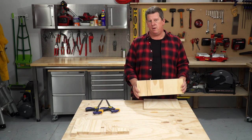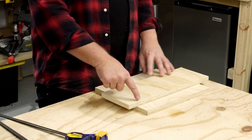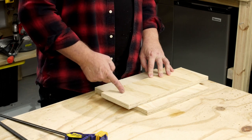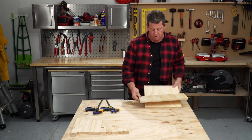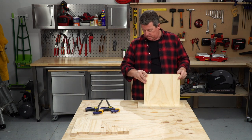The smaller piece of your plywood is going to be the foot. You want to find the centre here. This is 150mm so that'll be 75mm in, and then you want to put a little mark at 50mm in at both ends, because that will tell you where to position your upright template.